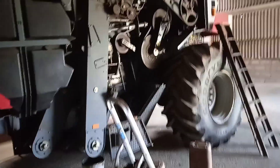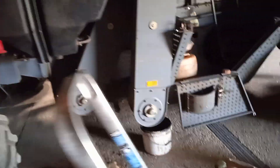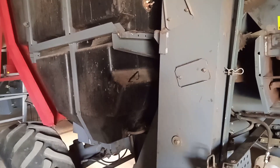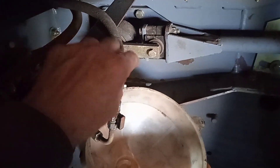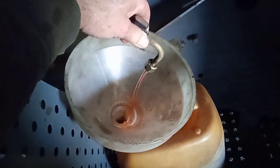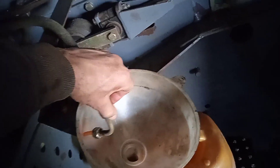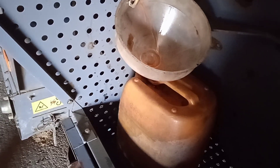That panel is off, along with the little bit of guarding from this corner. Right now I'm in the process of draining the tank - I'd run it low during last harvest but it's got about 100 litres in. There's a filter here with a pipe from it, and it's got a little tap on it for when you change the filter. It doesn't come out that quick but the good thing is you can turn it off with the little tap. So it's just a case of filling some cans up and emptying the tank.